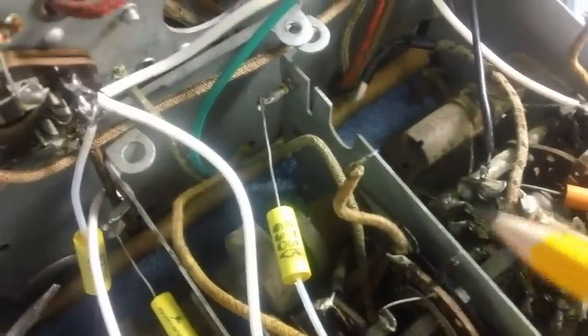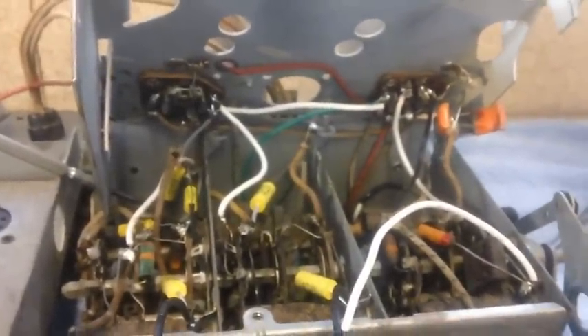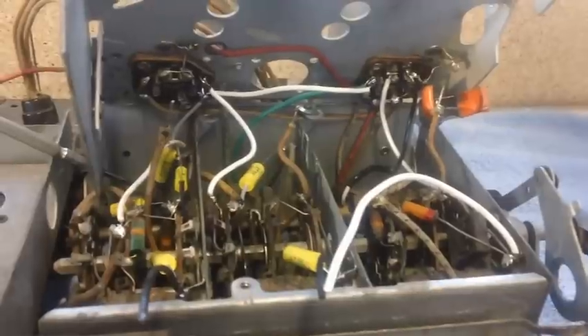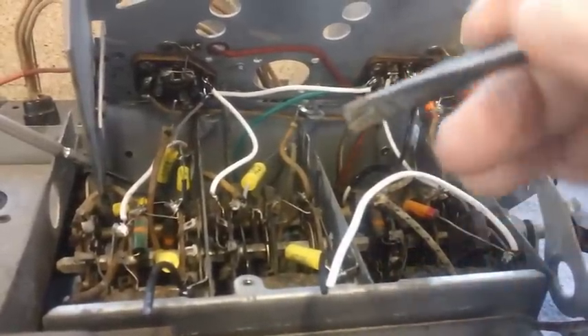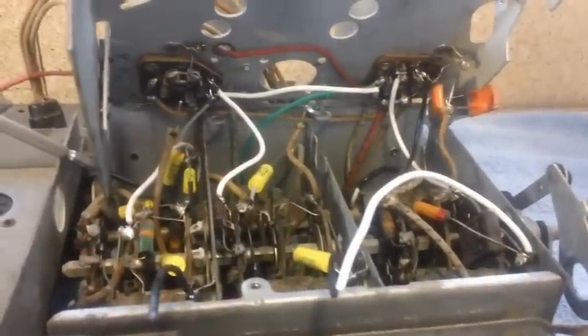It's not easy — it takes patience. But that's what it's all about; that's the fun part. When you get all done and the radio's playing back the way it's supposed to, you'll know you've done a good job. Just don't run out of patience. Cleaning sometimes takes more patience with these radios than actual component replacement. I can't tell you how cleaning will take a radio that just has static and all kinds of crap — clean it real good and it'll just suddenly perk right back up.